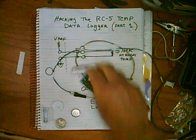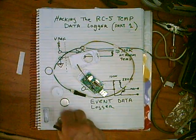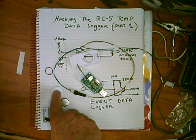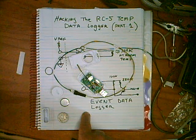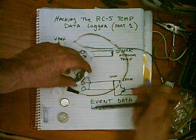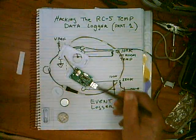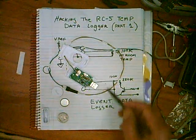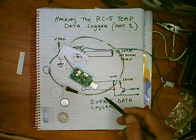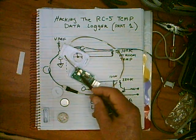They fit together in two pieces. First, you have to remove the battery — it's got one of these little covers in the back, and you really need to use a quarter. This takes an amazing amount of force to open it up. Once we removed the battery, at the end here they put some silicone around the USB connector and everything. I thought these would be all ultrasonically welded together and be impossible to get apart without really destroying the case, but that's not the case.